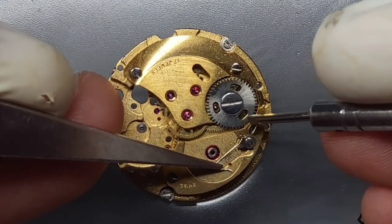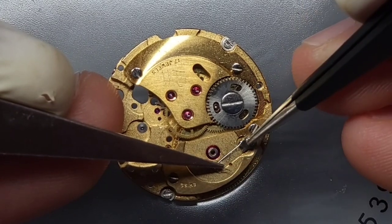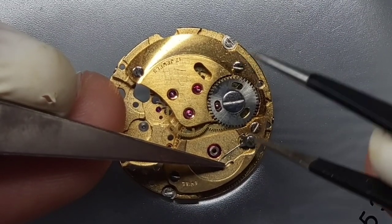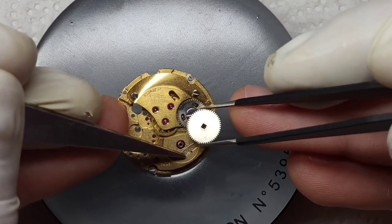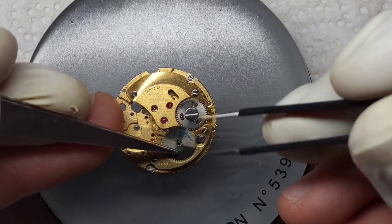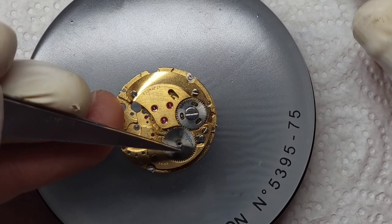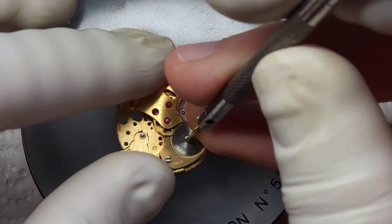I fought with this click spring trying to assemble it. I put the spring in first and was trying to get the click on afterwards, and frankly that wasn't working. What I found was the best thing is to put the click on first, then sneak the spring underneath it and make it fit at the bottom afterwards — that seemed to be the best way to do it. With that on, I'm going to keep constant pressure on it because I don't trust myself not to knock that spring off and send it flying. Now it's on, I can put on this lovely monogram sprocket which should retain that click spring. We're going to drop the screw in place and we should be about there on that side.